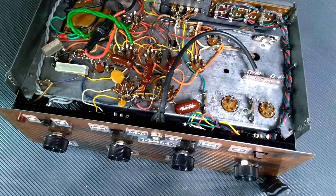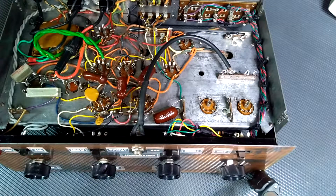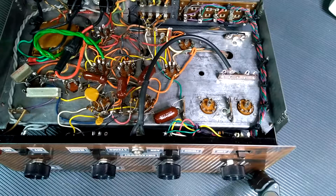My plan here — and some of you might cringe at this because it's a tube amp — is to get as much dirt and gain out of this thing as I possibly can. Initially I was going to use the two extra 12AX7 tube sockets from the phono input stage and tie those into the existing 12AX7 to give it more gain. But I think what I want to do is put a solid-state circuit in front of that first preamp tube, because I'm not sure the tube route alone will get me the type of gain I really want. I may still utilize those extra tube sockets after some experimentation.